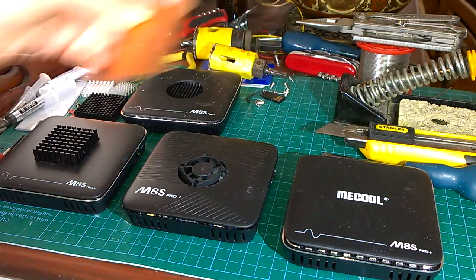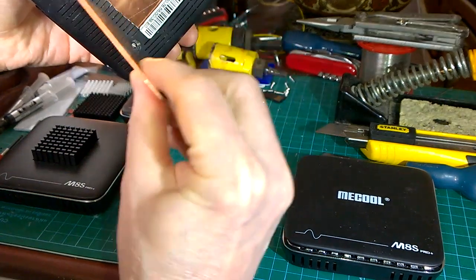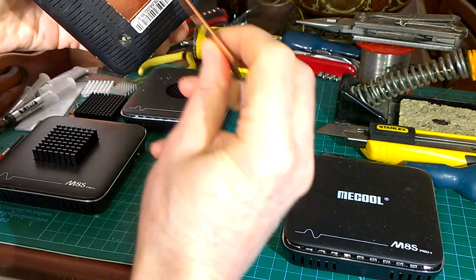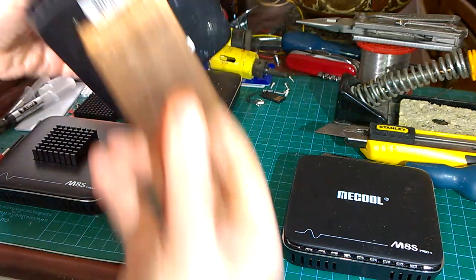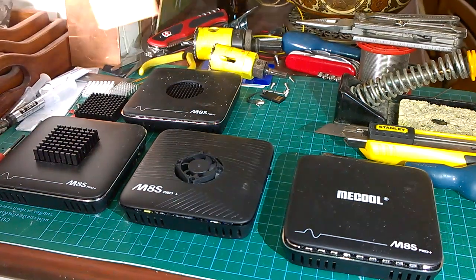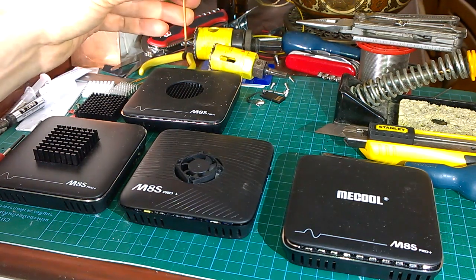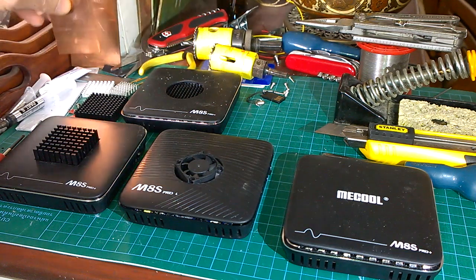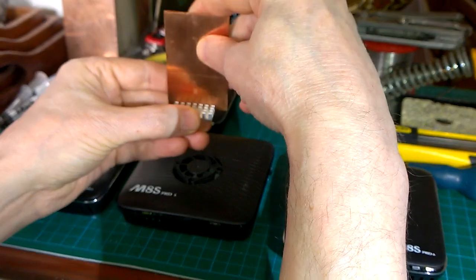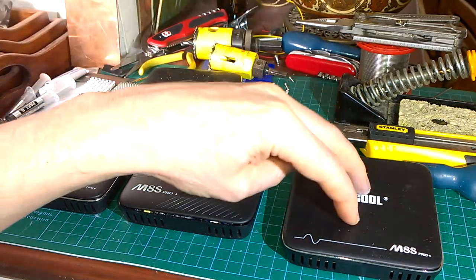This is the underfloor heatsink which fits in there. To cut it out, go along the very edge of the central square — which doesn't have the little air gaps — on both sides with a craft knife. That gives you airflow for your lower heatsink if you want to add extra heatsinking capability on the base. This copper is only marginally better than the aluminium sheet — it's 1.67 or 1.7 millimetres. It also works as a useful tool for getting your heatsinks off — you put it in and twist it, giving better purchase than your fingers.